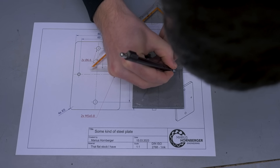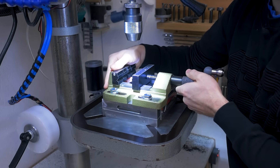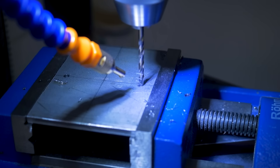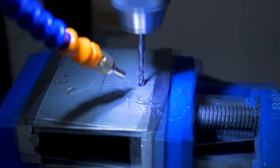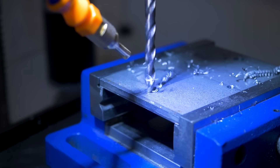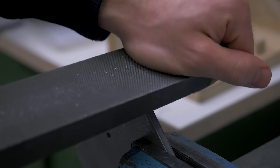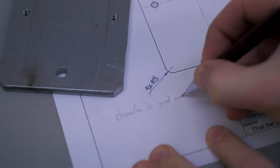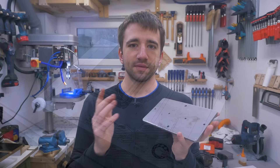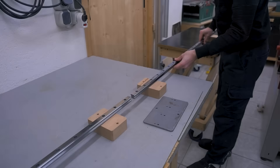Then I find the center and mark the hole locations from there — a perfect task for my newly made magnet vise. First, the M5 threads, and then the two through holes. After a quick deburring, I only need to make the rounds with a file. There it's done — all six of them. Then I made a big steel plate, which is basically two of the small ones in one, for joining the rails together.